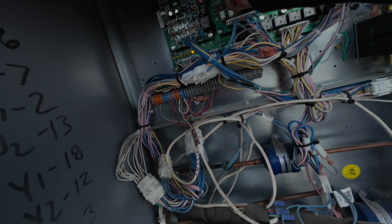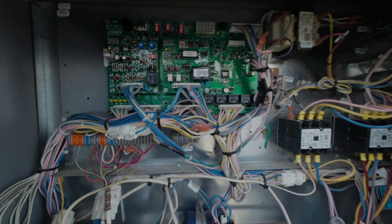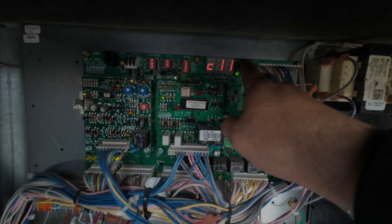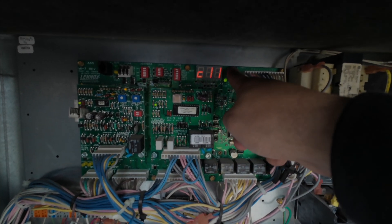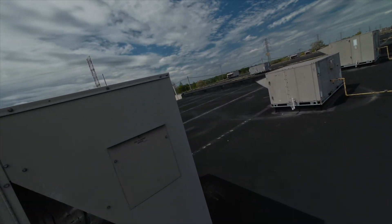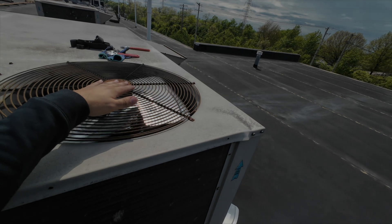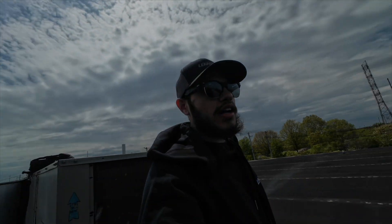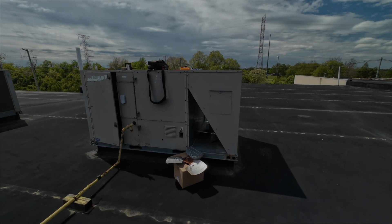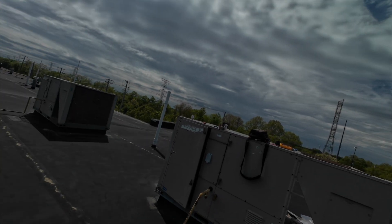Alright guys, now we're going to put it back in test mode. I'm going to hit shift, unit test — two dip switches right there. It's going to say C01; we want to test both fans and compressors, so set it to C11, then hold the button down for about five seconds. You'll hear both compressors come on and both fans are on — both are extracting heat. She's ready to go. Swapped out two condenser fan motors on these old Lennox units. We're going to go ahead and lower them down off the roof, clean up, and then we'll be out of here.